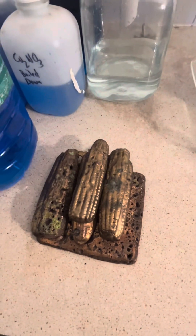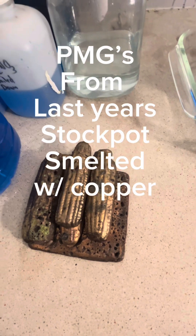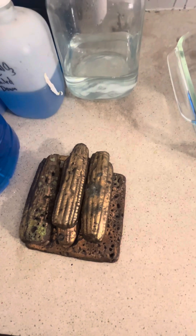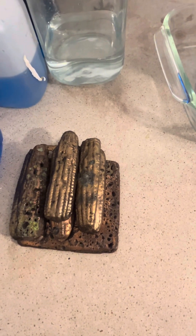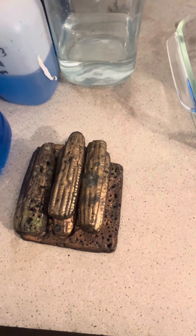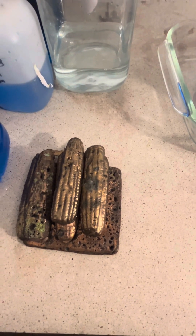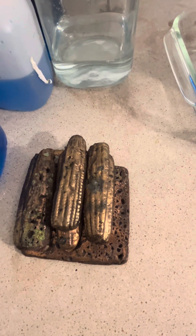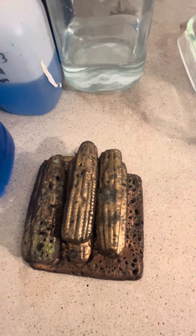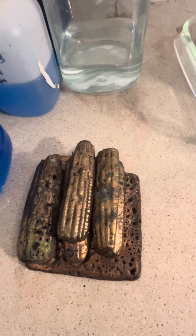I am going to use my copper bars from last year. I decided to put some of my waste and smelt it with copper because I gotta tell you I'm a little lazy when it comes to that stock pot and refining. I put everything in that pot and cemented out the values with copper. There were hydroxides, there were chlorides, and the best way I felt to do it was to smelt it with copper, go after the values, reevaluate the way I was handling my waste, and to separate the copper and silver nitrate solutions from the gold and get better at my waste treatment.